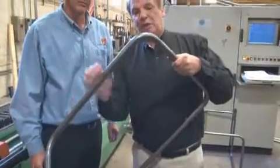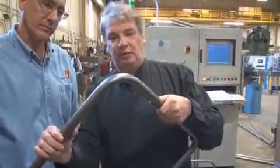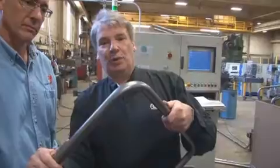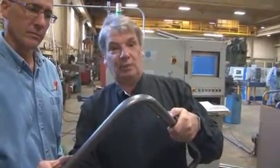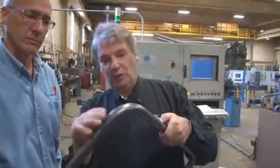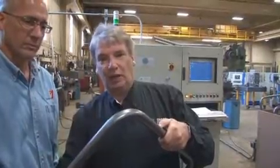Let's take a look at one of the bends. If this ovality is acceptable — in most cases for generator frames and furniture it is not a problem — this would be the bender to use. You do need approximately two times the diameter of the tube to bend. In this case, this is a one-inch tube bent on a two-and-a-half-inch centerline. On a one-inch tube, you need at least a two-inch centerline to get acceptable bend quality.